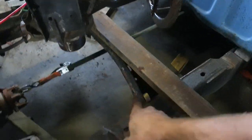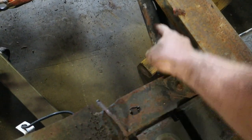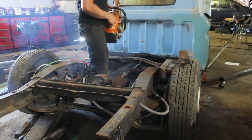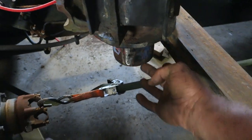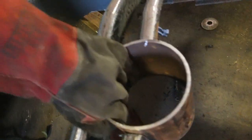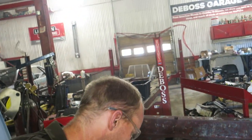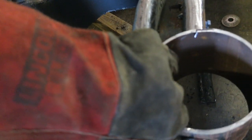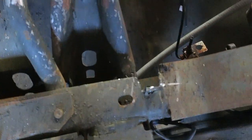The turret has to go in front of this main brace. I have an identical one which I'll put right here — I might cut this flush and weld the two together. I'm going to cut a five and five-eighths inch hole in there to accept this pipe right in the middle. That will be welded to the top of this, so this unit will be 100% attached to the truck and nothing else. We'll weld this in place to the right height, but it is pretty critical that we get it straight.